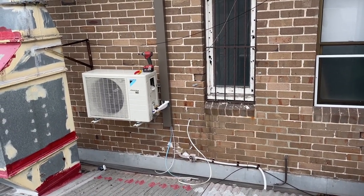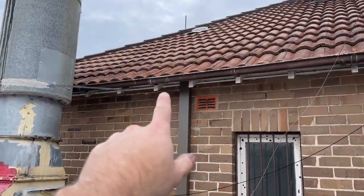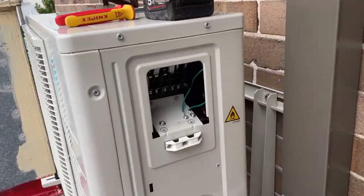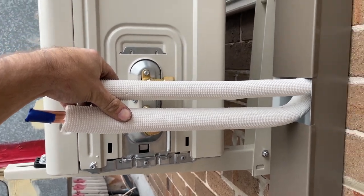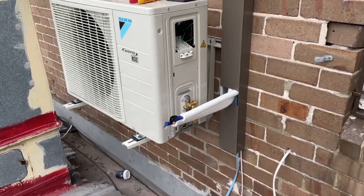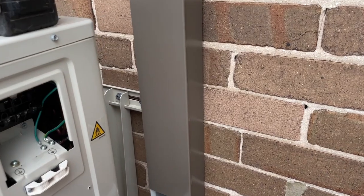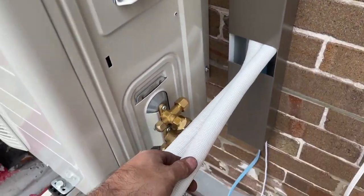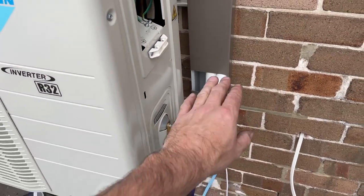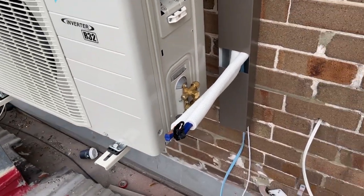Anyway, so same level as that, trunking comes down. I've used the benders, so basically it's like the perfect across. So I'm going to cut that, flare that. What I said before was I was going to cut the insulation and use the black fire rated stuff, because I think it works better with the UV. So there's only going to be from there to there that is exposed.